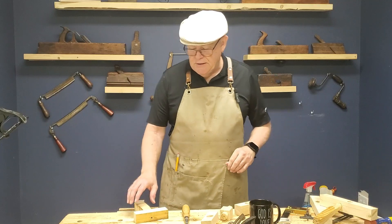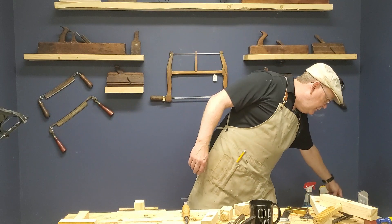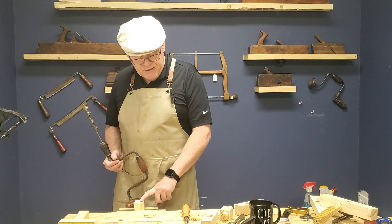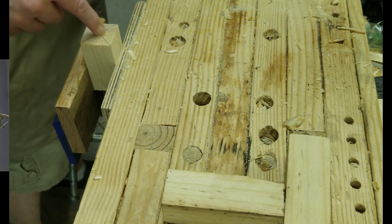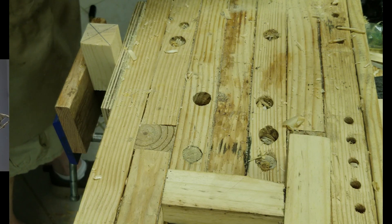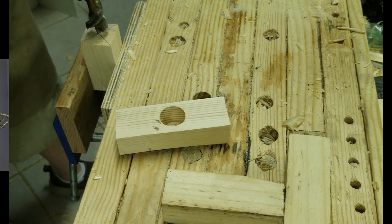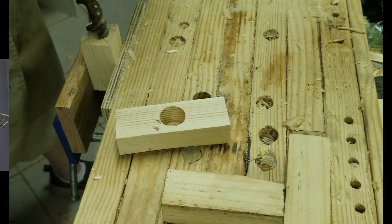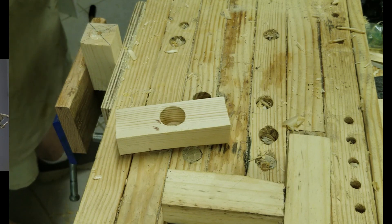A couple of things that you need to note: you should use the same size auger bit to drill the hole — use the same auger bit to set for the tenon as you do for the mortise. If you can see here, we have just found our center. I used a center punch to just get started — that is absolutely not necessary. I have already drilled out the mortise part of this, and now we can just put the auger bit in there. We are only going to go down deep enough so that we score the top and we know the exact area that we need to carve out.